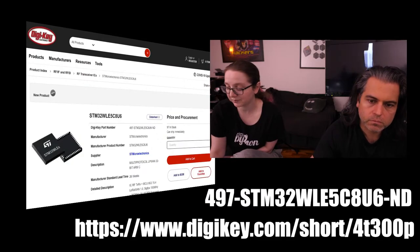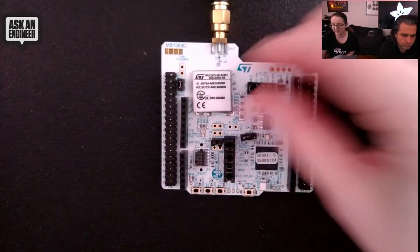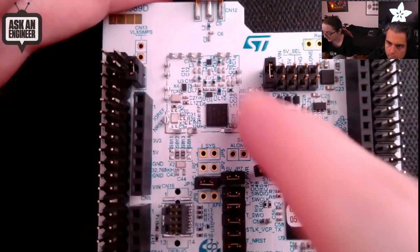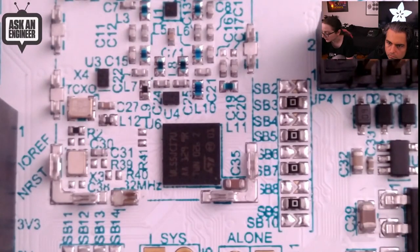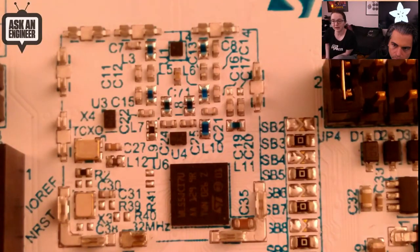Let's look at the overhead real fast because I want to show you the Nucleo add-on. It's kind of cool — it came with a little tin and I just removed the tin. It actually wasn't even soldered on, it's clipped on, which is pretty sweet. Let me zoom in into the analog section. This is the chip — the one I picked was a QFN, but it does come in BGA if you want it really small. You will need to create your own analog section — it has a radio, but you have to handle all the antenna interfacing, and this is the antenna.